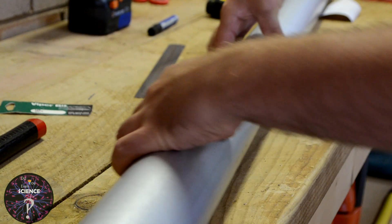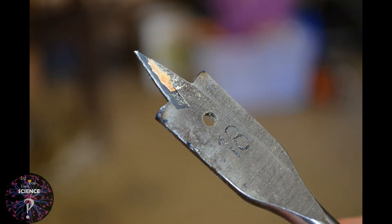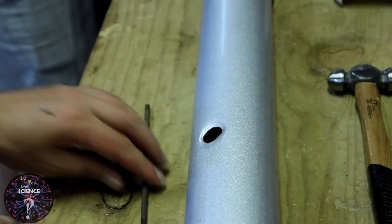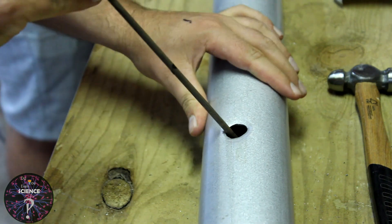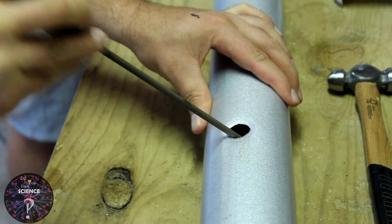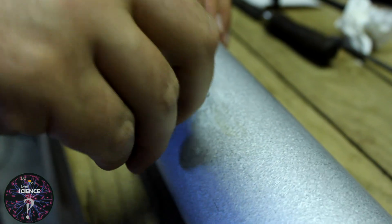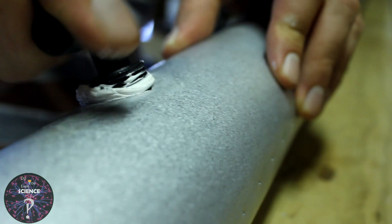Make life easier for yourself and clean up as you go. Next up, roll the pipe at a 45 degree angle from where you were and secure. Mark in half a metre from both ends, then drill a hole 18mm in diameter. Don't use a spade bit — these are used for wood and it will be ruined. Use a file to remove any jagged edges as you don't want them cutting into the poly, and you may need to widen them slightly so you get a nice snug fit. Remembering that gas will be going through this, you want a nice airtight seal. Using a liberal amount of polyurethane, coat the T-piece and screw it into place to make a nice airtight seal. You will need to add more glue around the edge to make a proper seal later on.